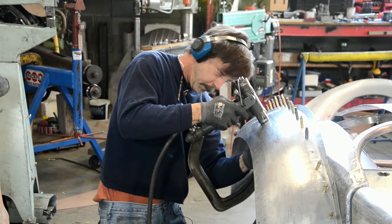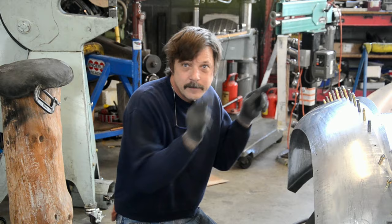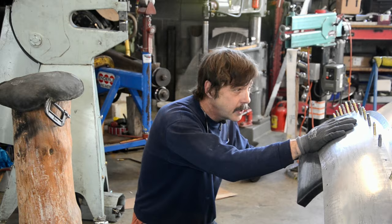Okay, a lot of you may be wondering, how was he able to do this? How can I build a whole car from scratch? In back of me and around me are the tools, every tool that I used to build this whole car. Okay, number one tool was shrinking. I did a lot of shrinking. All these corners were shrunk in. An awful lot of shrinking achieved with the Marchant Shrinker.